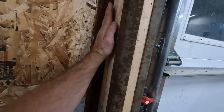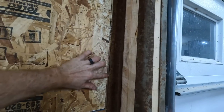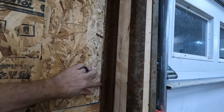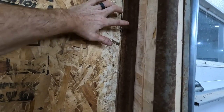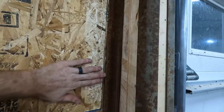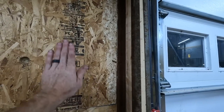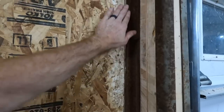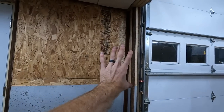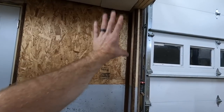The pillar is nice and flush. So I had to put a piece of plywood in there to fill that gap, and it was too thick. So I used my electric planer and planed the backside of that plywood down, and then it was slightly high on this side, so I just used the planer and I kind of just went right over where you see the light section just to kind of feather it, smooth it out, so that when we get whatever we put there, I haven't decided yet, it will be flush, smooth, and you won't even see any bumps.